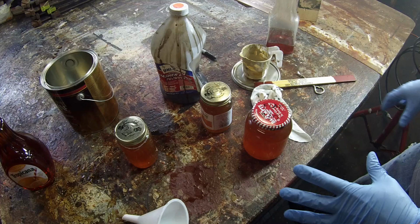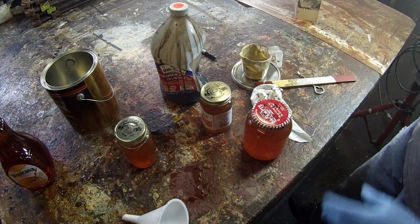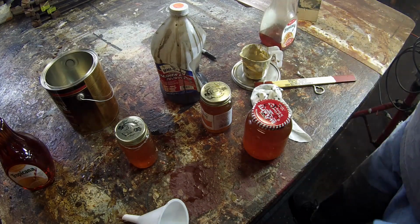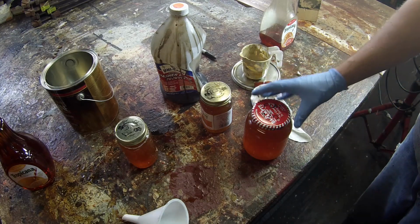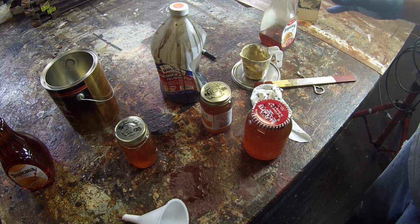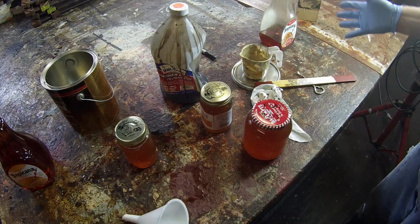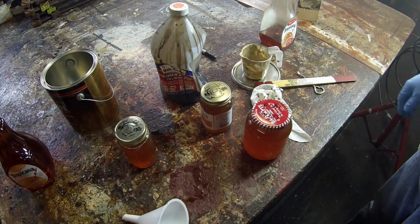Sometimes for darker colors, like black, I'll add a little bit more of the cut polyurethane component just to give it a little bit more gloss, because on darker colors the dead flat sheen will actually make it look a little bit pasty, so it's okay to add a little bit of extra gloss into it. And then for the lighter colors it doesn't really matter, so I just keep it the dead flat.